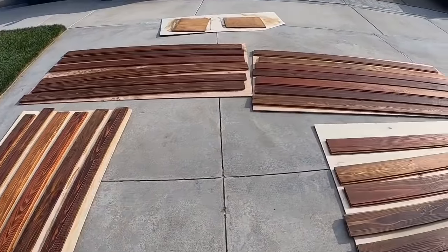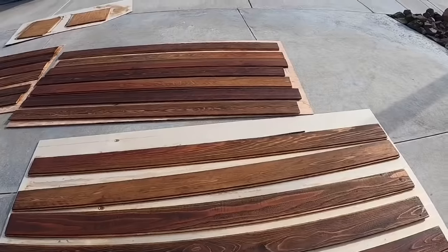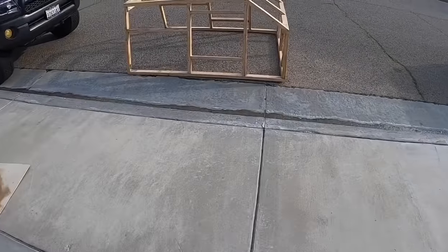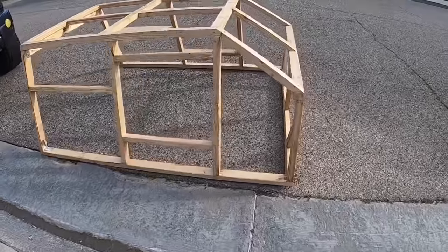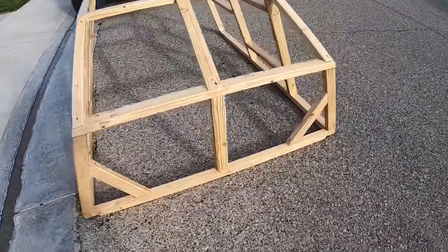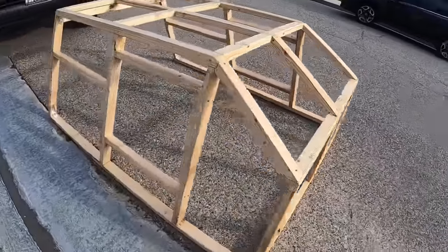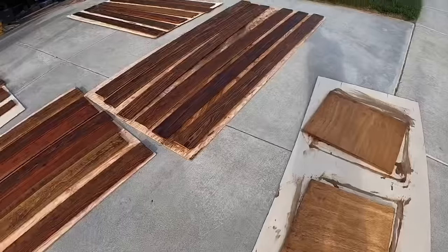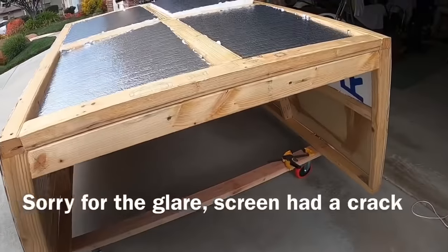Next, I got my exterior redwood. I applied a stain to it, also a weatherproofing sealant. I use that same sealant on just about every piece of wood, including the framing you see here, just to ensure that the lifespan of it would be prolonged. Water seepage is a real thing when you're out camping, especially with moisture, so preventing that is critical.